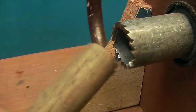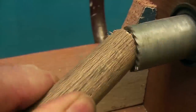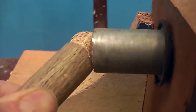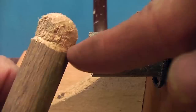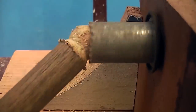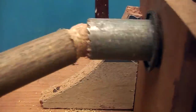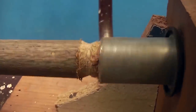You are going to start by grinding around, going along the top. You will find that as you go on a 45 degree angle to try and get the top of that ball rounded, it will start to chew into the bottom here as well — but just keep going. Keep grinding around, and you will see you have got your little ball on top, but keep going because you want it to reduce in size until eventually it's actually going to go into the pipe itself.